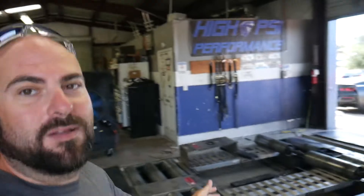Welcome back to the High PSI Performance YouTube channel, I'm JD. This morning we've got the dyno blown apart — the brakes are air-powered brakes that slam up against the roll to keep it from spinning when we pull vehicles on and off. The original rubber brake pads failed, we made some out of a trash tire and those held up for a long time, but they finally ripped the rivets out. So we've got the dyno apart to get them fixed, put some new rivets in, and hopefully they last a year or two.